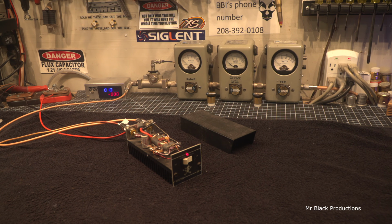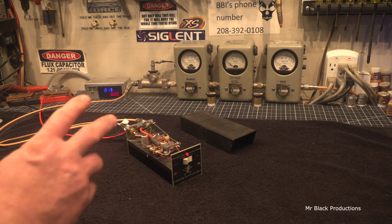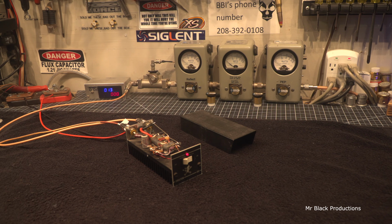So I thought, well, if you're going to build a Mona Lisa, build a Mona Lisa. So now what's in here is 2 Toshiba 2290 transistors instead of 1446s. Real deal, old school Toshibas. Hello, audio, 1, 2. That's 200 watts at 12 volts.